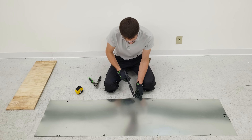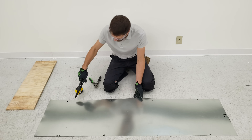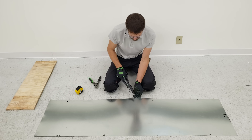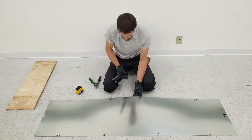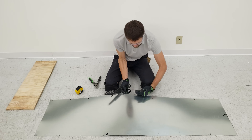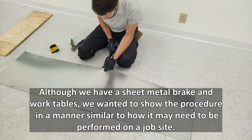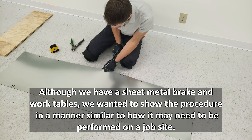Right now we're cutting our little half inch triangles on the factory side of the metal, and on our cut side that's where the end cap goes. We're going to be cutting these little half inch triangles because we're going to be folding this up half an inch in order to mount this to the air handler. You can use tin snips just like this — it doesn't have to be huge triangles.